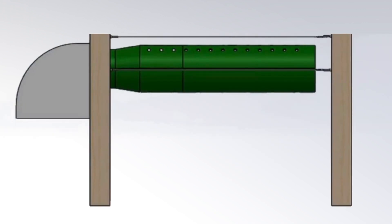Next, hang the flap duct onto the suspension cables at 3 and 9 o'clock using the clips sewn onto the tube. Typically, the side with the larger holes is positioned facing downward. Some flap duct models come with additional clips at 12 o'clock for an associated 12 o'clock suspension cable.